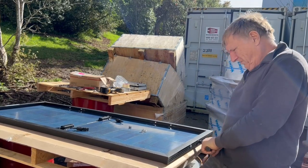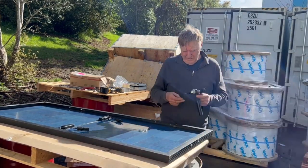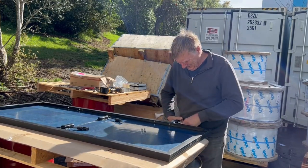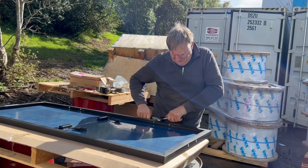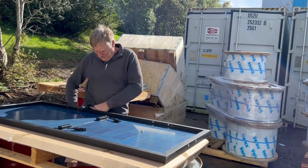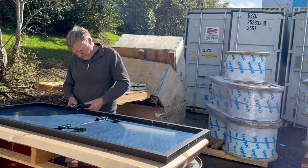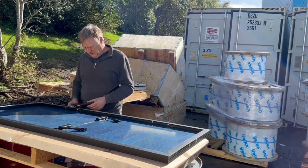Fitted with high quality split junction boxes and 2 bypass diodes, the top half of the panel operates independently from the bottom half of the panel. So if there's any shading on the top half, this does not affect the bottom half, and vice versa. This panel has 4-way anti-shade protection. Unlike traditional 36 cell panels, where if you cover 1 to 2 full cells, the entire panel would drop below 5%, with this panel you avoid this issue.